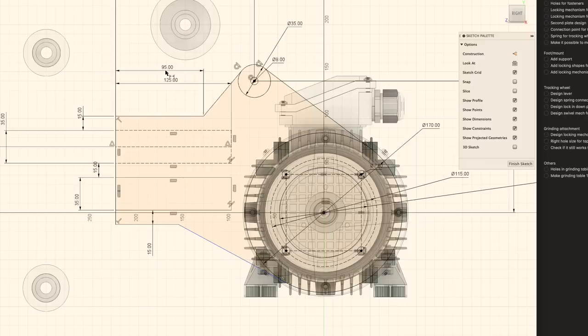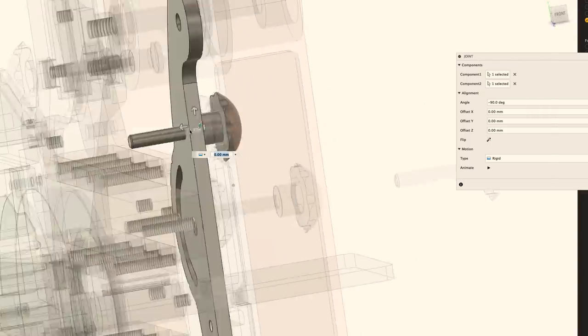As you can see, I designed this all from flat sheet. That makes it possible to get the parts cut out by a laser cutter, a plasma cutter or a water jet. This may seem like a whole different world, but it's fairly easy. Export all the parts as a step file and look for a laser cutting service online. There are more and more online services that have a tool where you can upload your files and directly see the price.